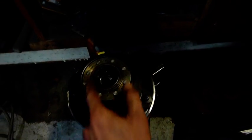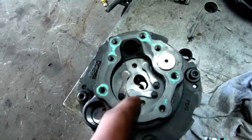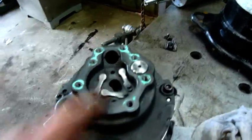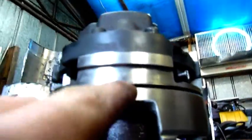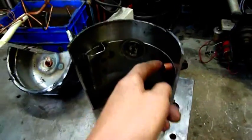Normally the high pressure side would be up here, isolated by this seal, and all this casing would be low pressure. In this case we have high pressure coming out of the centre here with a series of reed valves for staging the discharge and probably smoothing it out. But there's a passage going straight down here and through here — you can see the little passageways drilled through where I've cut. Those slits are from the grinder, but underneath you can see where it comes out into the motor housing through this baffle. So it seems the outer housing is the high pressure side, with the high pressure output there.